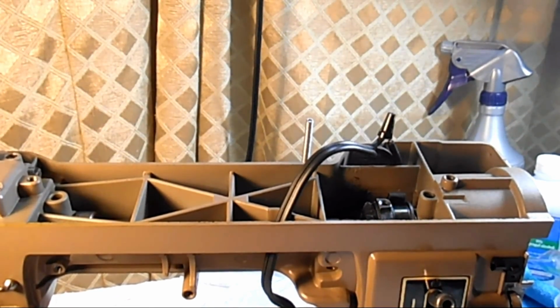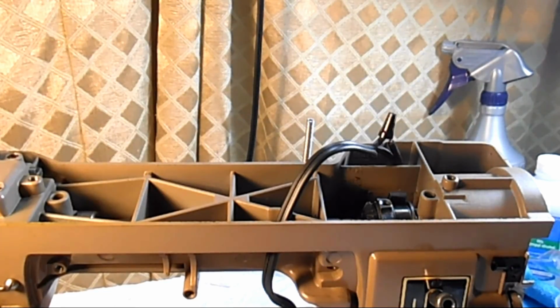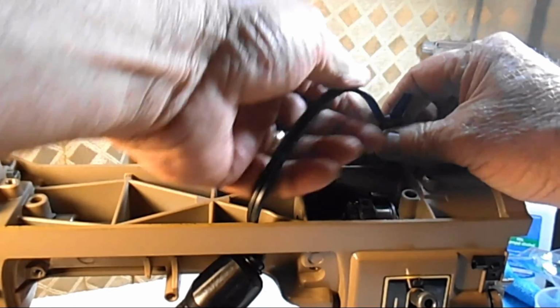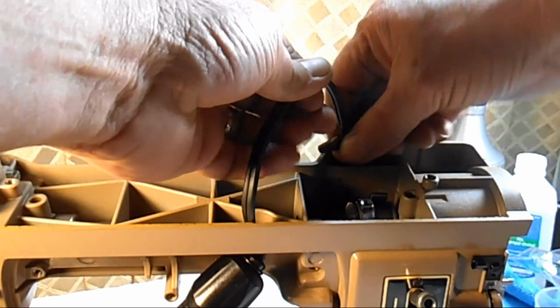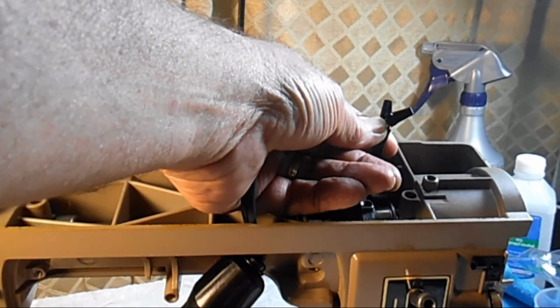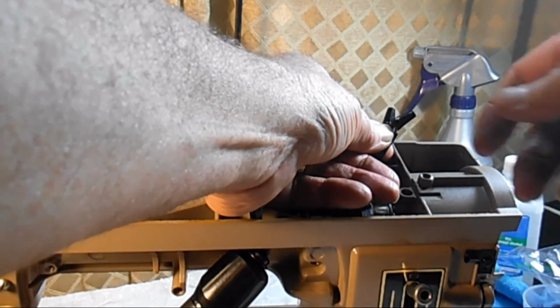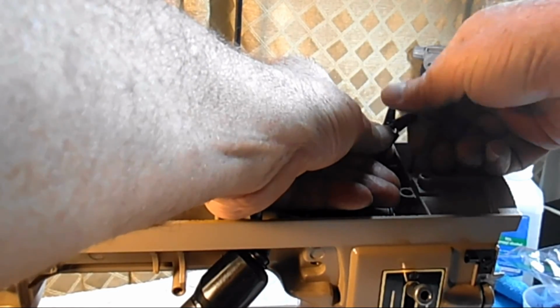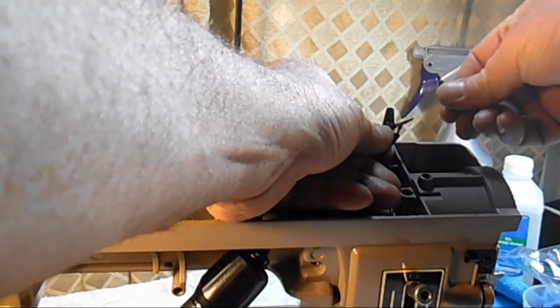If you want to wrap the stuff with plastic and tape, or I'm going to show you right now how I take it out. And then you could leave it in like my buddy said he does and take your chances. But the wire nuts are very easy. It's a nut, so it just unscrews. And the idea with it is don't pull it, just lefty-loosey. And like a bolt in a nut, it'll lift itself off, just like that.